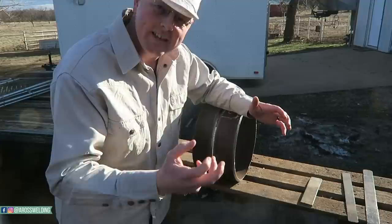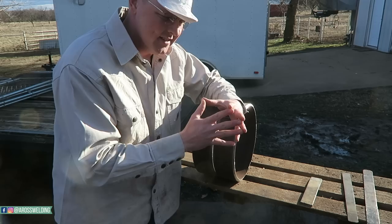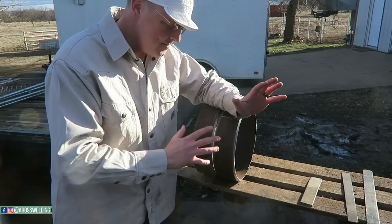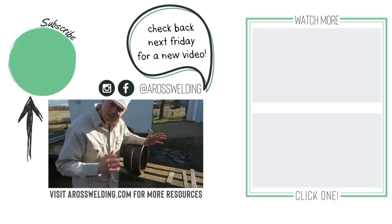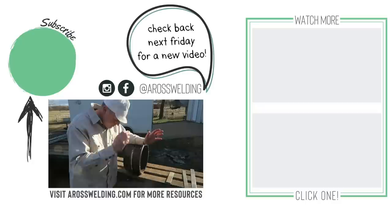So what I said about sanding it down to make it fit, that is huge. No matter what size of pipe, if you can make it fit real good, take your time and get it blacked out all the way around, that way, whenever you space it, it's the same all the way around. But that is my advice for this week, it's all in the prep. Prep it good, your bead goes good, your hot pass goes good, everything goes good from there on out.